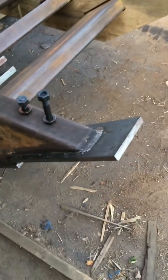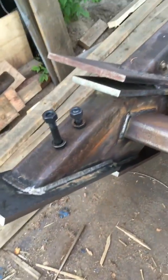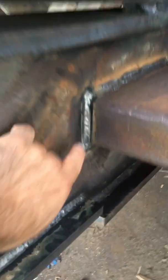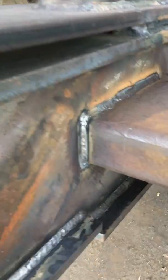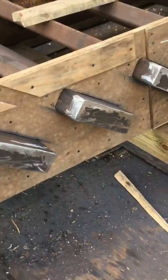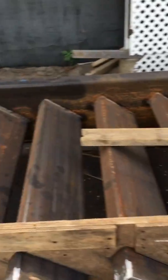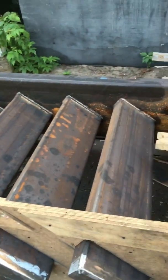This flips over and supports underneath the top platform. This is what it looks like all put together — it's all welded with flux-core wire, and my father was just touching up these edges and he's going to finish them off today. That's the finish — they're just going to rust and match everything else. It's an ocean patina finish; the steel will darken as the salt air hits it, getting darker and darker.